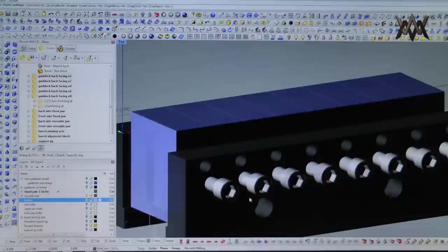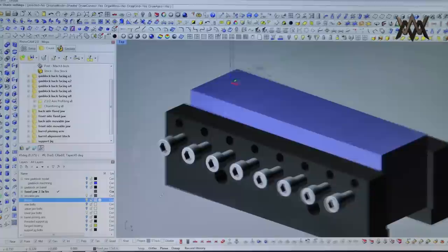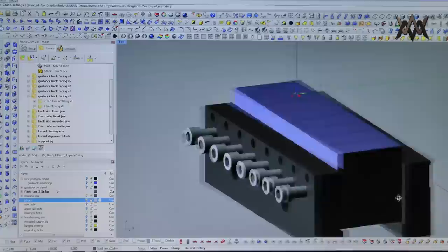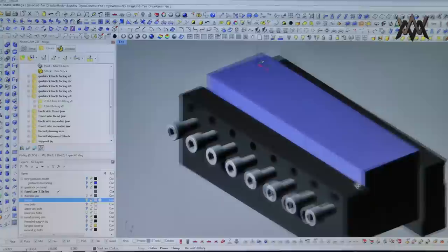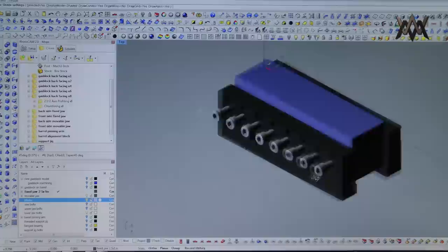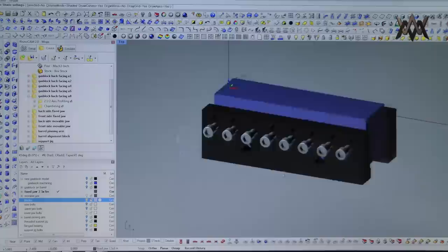I'm going to use this perhaps in conjunction with also running a piece of aluminum wire across the face of the jaw just to make sure that everything is seated properly. And another advantage of these jaws is you can run that wire around the side, stick it out here, and then wrap it around the bolts on the end to hold it in place. So we'll see how that works.